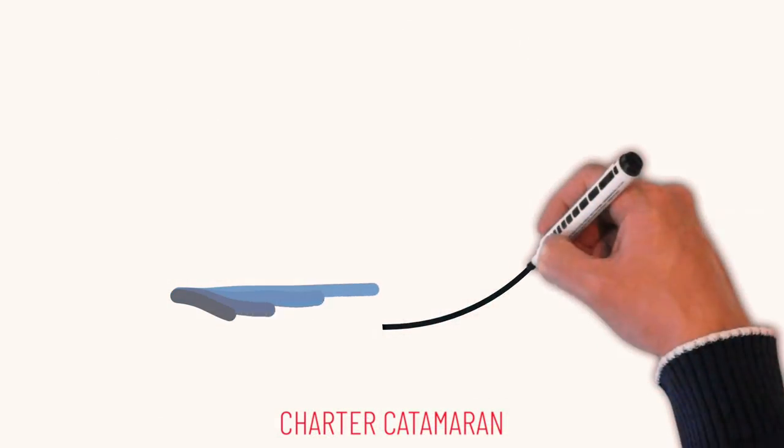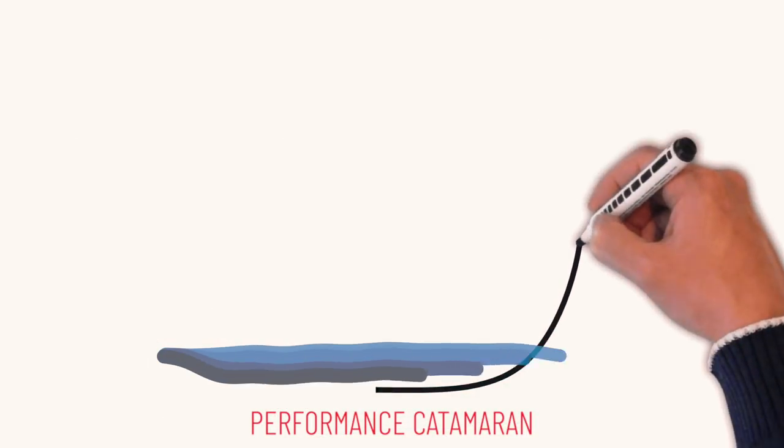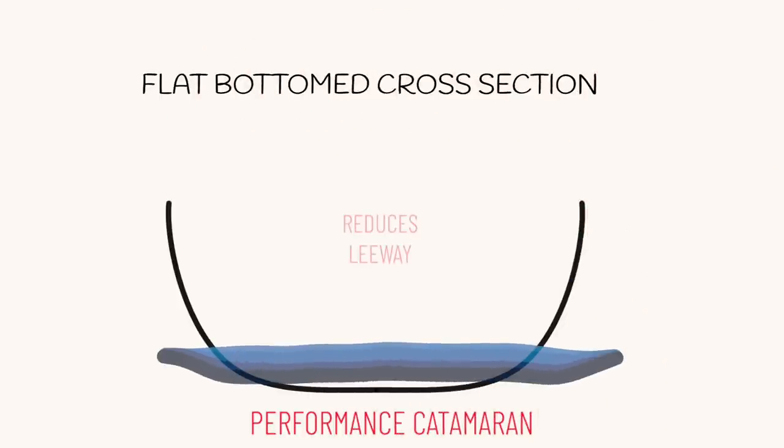The second point is about the cross section of the hull. If you have a perfect semi-circle in cross section compared to something which is flat-sided but with a curve at the bottom, those high sides and the angle — having sides that go straight up and down — stops leeway because it creates lateral resistance in the water. When designing catamaran hull shape, you look at the angle of the topsides to the water and make sure there's less curve.